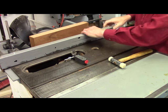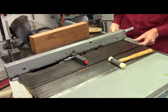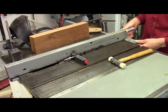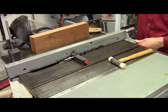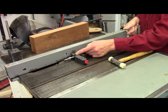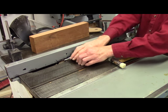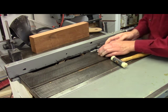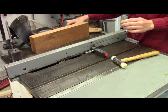Now I'll lower the saw blade down into the base. This is why we had to get rid of the throat plate — I need to bring the fence over and have it contact that bearing. I've got a 1970s-era Craftsman table saw with a fence that's not the best, but as long as I keep the rails waxed it works quite well. Now I've got it just barely touching the fence, and I'll lock the fence down, then bring the Mighty Mag back a safe, convenient distance away from the blade.